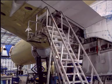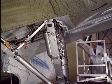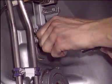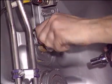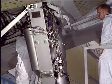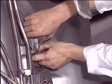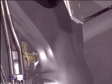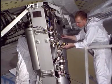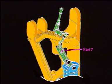On the top of the landing gear leg, remove the outboard shortening mechanism proximity switch support. Unscrew and remove the safety bolt securing the collar of the shortening mechanism point 7. This point refers to the shortening mechanism pin 7.